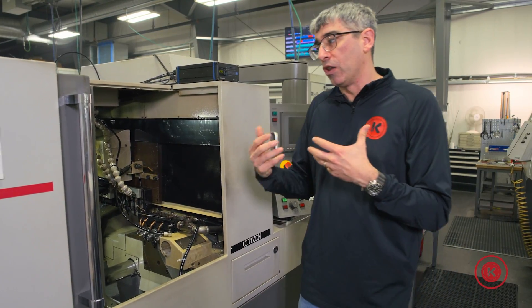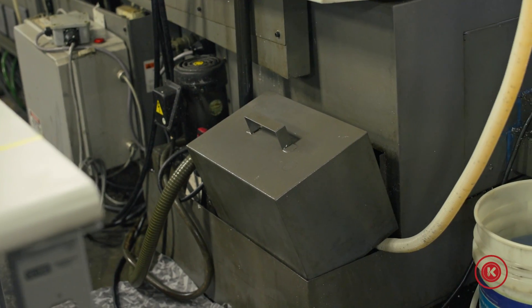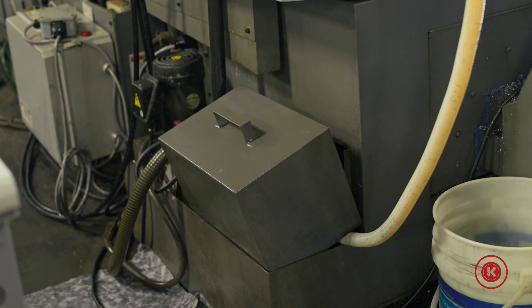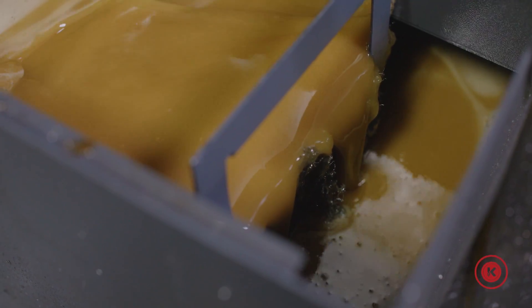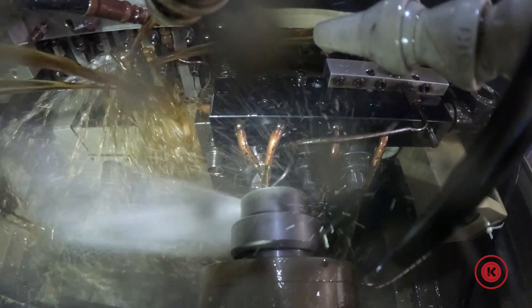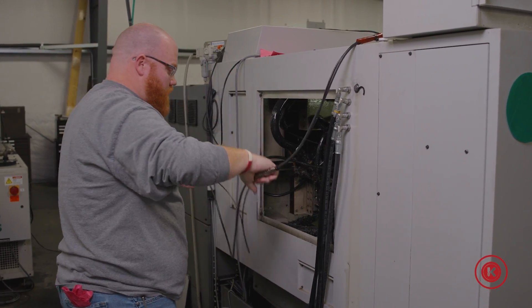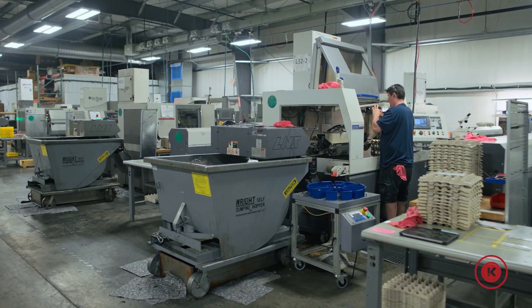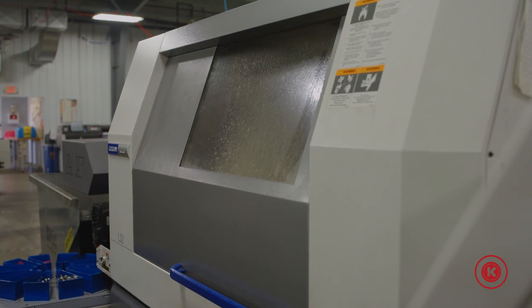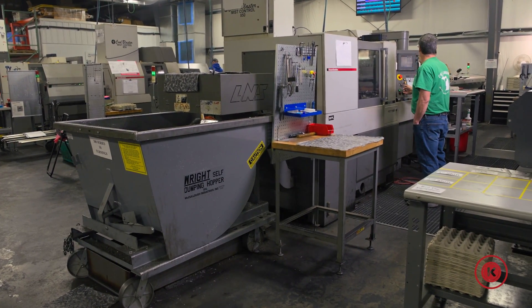Some things that are a little bit concerning or you have to watch out for: again, you need to take care of your bar feeders. Coolant flow is an issue with this machine — we had the same issue on our L32. One thing that stops us every once in a while is just getting the coolant to return back to the tank to get rid of those low coolant alarms, so you have to watch that. You are limited on your live tooling options and what you can do on the back side of the machine with the B arm. But if you know what you're running, you'll put it in the right spot — on the L32, K16, or a different machine — so you can keep this running more basic parts.